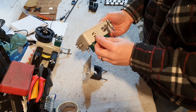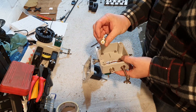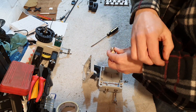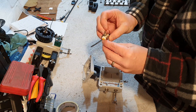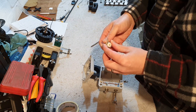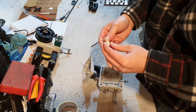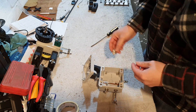The SO239 that I'm using — these are really top quality. I get these from a seller on eBay here in the UK; he imports them. These are gold-plated contacts and the dielectric is PTFE, so you won't melt these. They're just fantastic. They're not cheap — about £4.50 delivered from his eBay store, something like that — but they really are good. You don't want to scrimp.